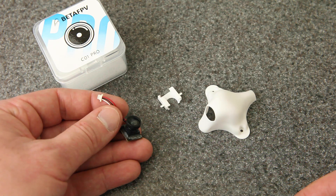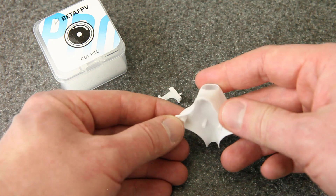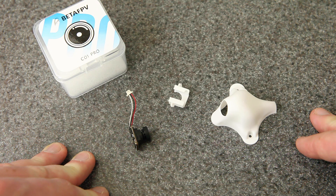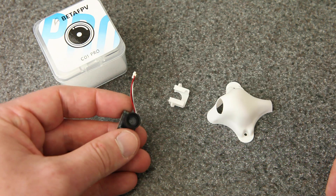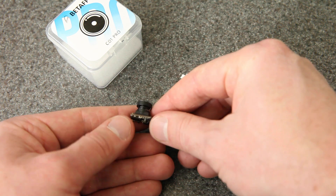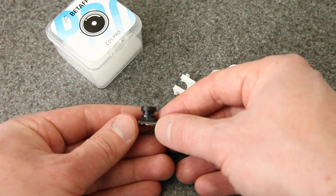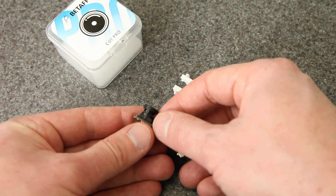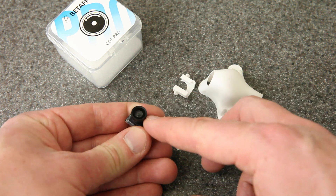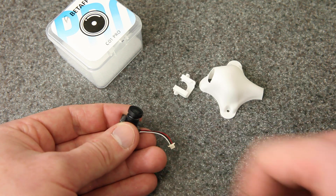Finally, there's a new whoop camera called the C01 Pro, which comes with a new molded plastic canopy. The camera goes into a mount that screws up inside the canopy — it's definitely more durable, though you can only use one camera angle with no adjustment. The camera itself has a larger sensor — the same sensor as the Runcam Nano 2 or Nano 3 — which is a huge upgrade in image quality compared to most whoop cameras. It's going to be about the same image quality as the Runcam Nano 3, but it is almost a gram heavier due to the more traditional whoop lens. Any advantage it has will be in lower light, since that lens allows more light in than the Runcam Nano.